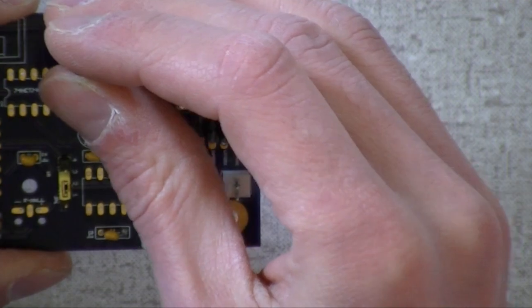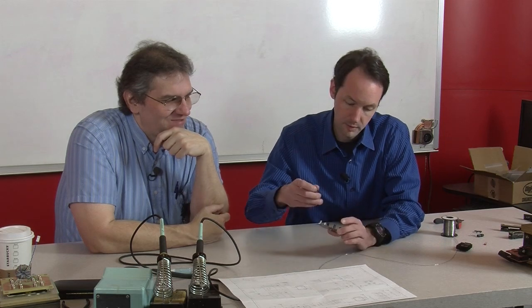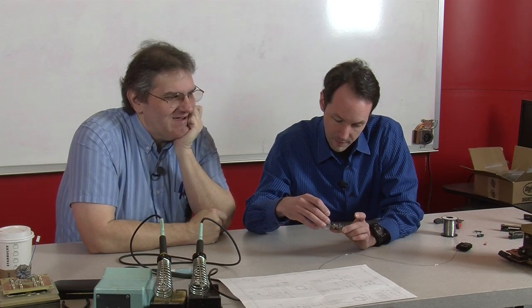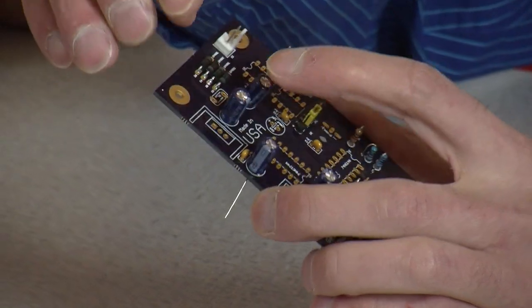Because these things cost a billionth of a penny a piece and are made 100 billion at a time. That's fine, but if you only got five and you need five, you don't want to kill one. And it'll get pregnant and blow up on your board. They get fat, they expand, the end blows out. You'll notice the stress marks on the end of the cap. That's where it'll burst through. They plump when you cook them.